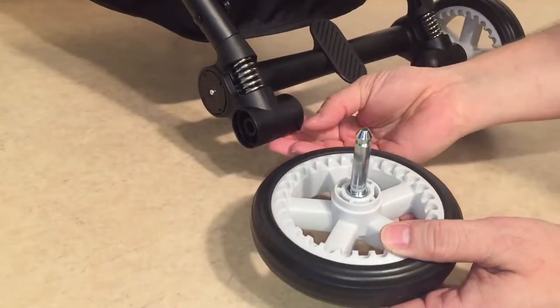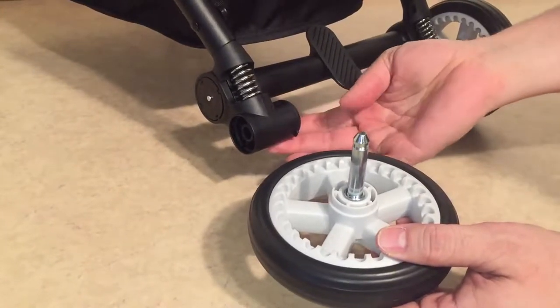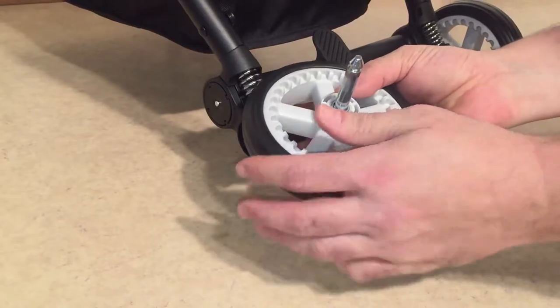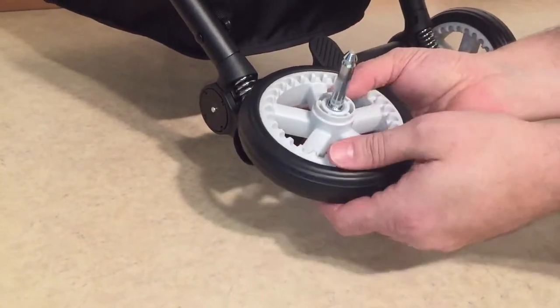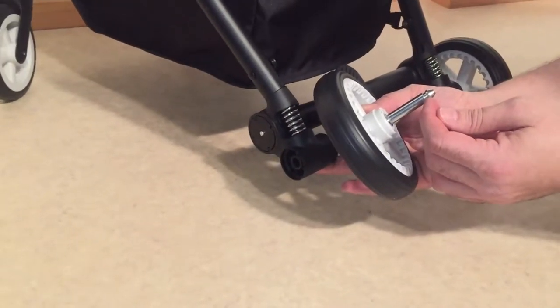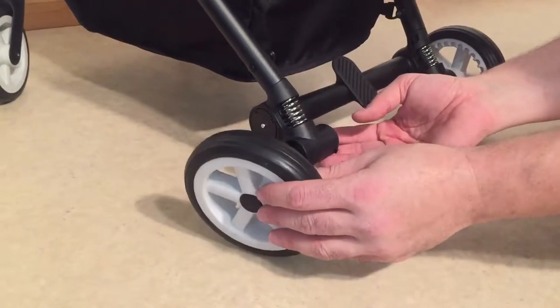What's happening is that this metal peg is attached to a larger piece that has a hole in the center, and this is changing the position of that hole — either so that it fills up the circumference of the axle so that you can pull it in and out, or so that it pulls against the groove in the axle and locks it in place.